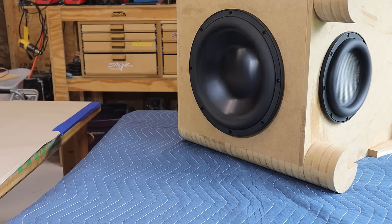It's doing what I want it to do — it's not terribly loud and it can hit those low notes. But did you notice a weird sound? You can really hear it at higher excursion. It almost sounds like paper flapping in the wind. That's an air leak — there's an air leak somewhere in this box. Let's take a look and see if we can find the problem.